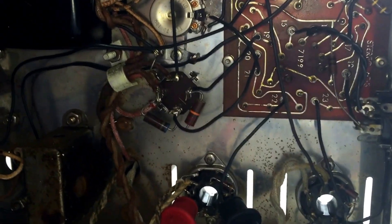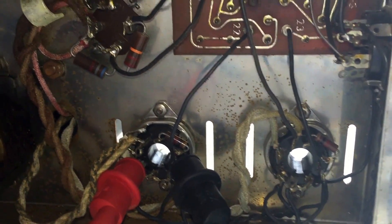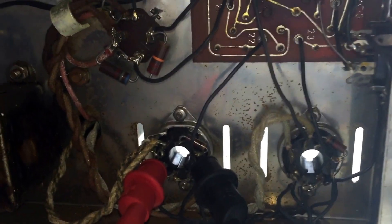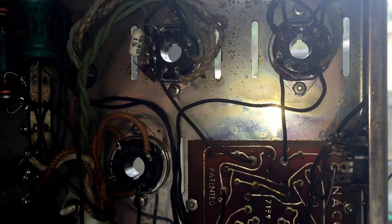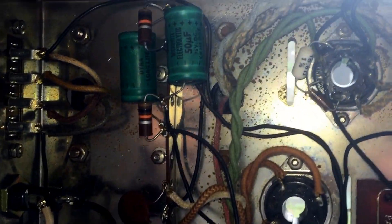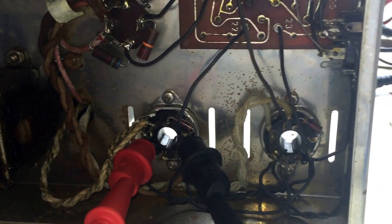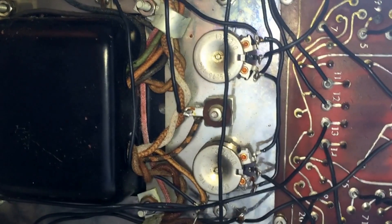At 25 volts, I'm looking through and trying to make sure certain things are okay — notably the heater voltages, the 6.3 volts for the heaters. Because it's only 25 volts, the heater voltages are registering 1.45V. The purpose of what I'm doing is, number one, to get some low voltage AC going through these electrolytic caps to get a little bit of reformation from them, and also to use these voltages as a sort of AC signal trace to check voltages and watch as I double it from 25 volts onward to 50 volts to see if the ratios in the power transformer follow those changes.